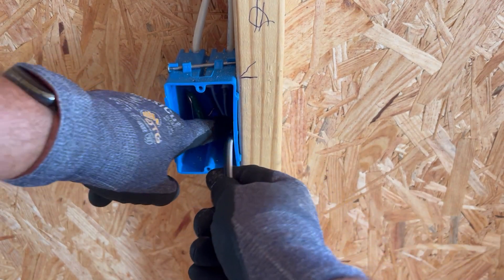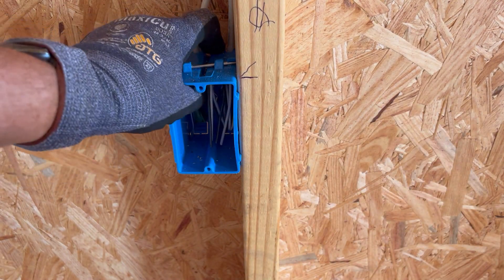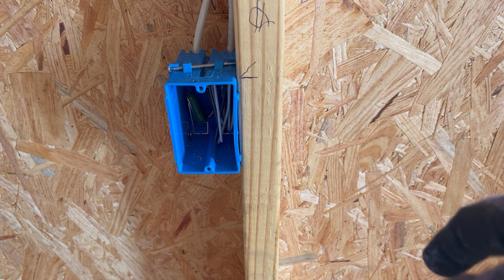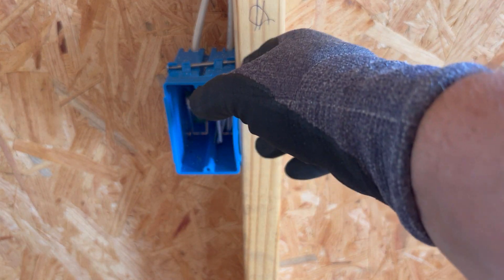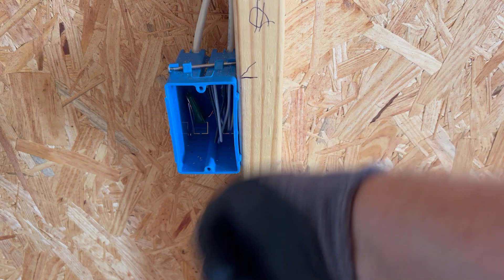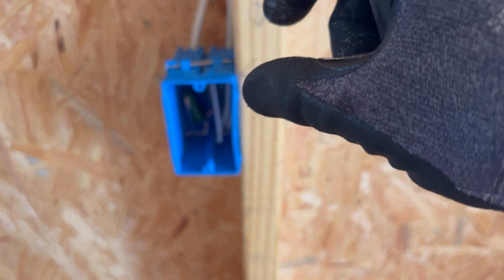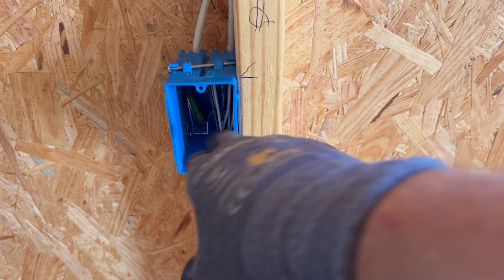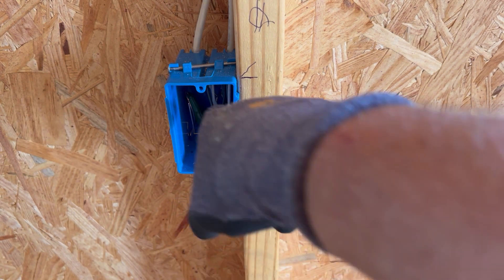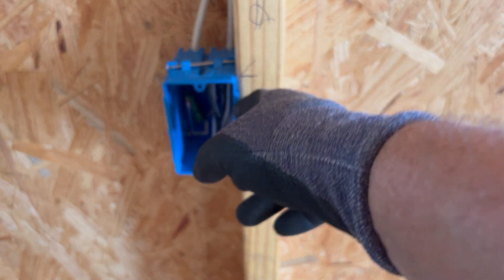These other ones — you don't have to tie them together or anything yet at this time. Push them in, out of the way. You want to get them as close to the back of the box as possible. Why? After they slap the drywall on top of this, they're going to remember there was an outlet here and take a roto-zip machine and just plunge it into the wall in about a half a second. The roto-zip tool is just long enough to cut the drywall — maybe three-quarters of an inch. Drywall's half inch. If your wires are hanging out, it's going to get tangled up and cut to hell. So push your wires into the box. If they get the inside of the box, it's okay — it's not going to damage anything.